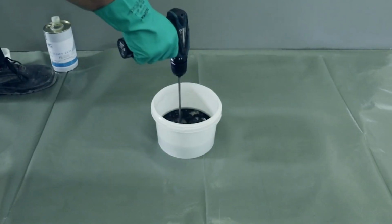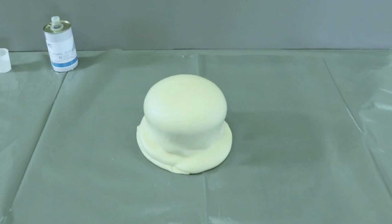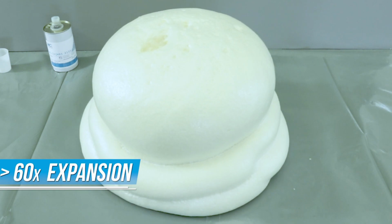Before injection, dry structures need to be saturated with water for the MC-Injekt to effectively penetrate the structure and form a flexible, permanently waterproof foam body. It's a fast and reliable solution for concrete cracks as well as for brick and rocks.